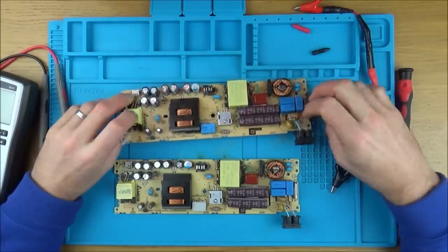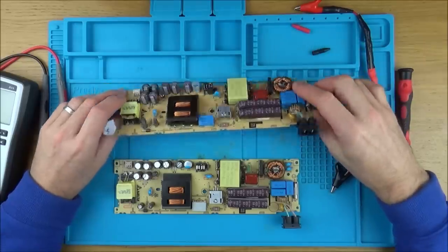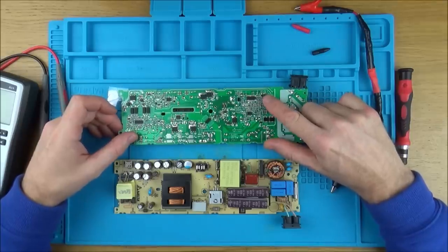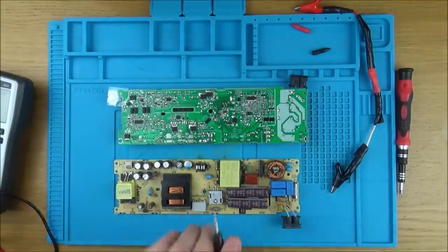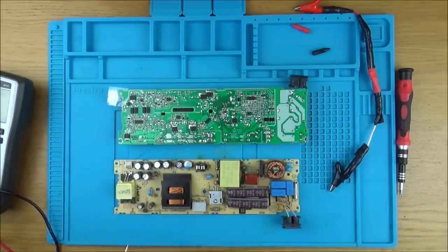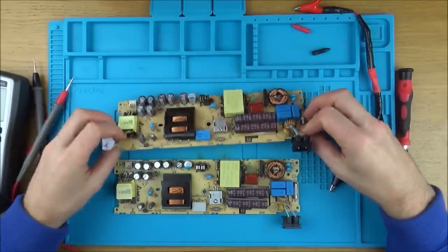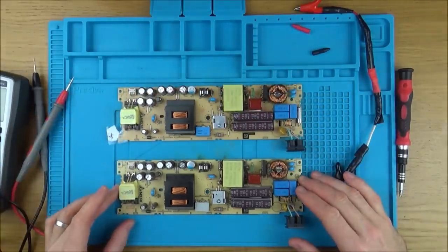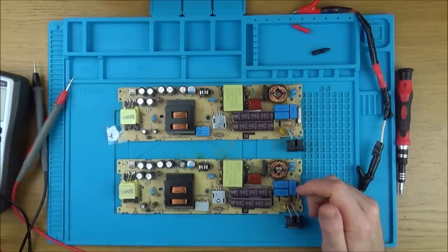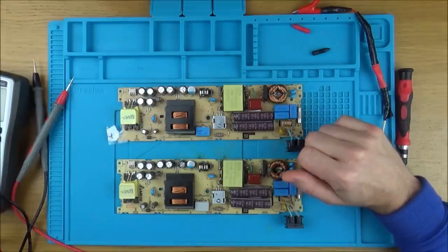I had to change over this MOSFET here and the fuse was blown, but still it didn't work. At the time I thought the only thing wrong with it was a little diode down here, because if I put my meter on continuity there was a short across it. I thought it might be the chip controlling that which had shorted — I didn't really know. Quite a few people said they'd like to know what was wrong, and one word kept coming up over and over: check the bridge rectifier.